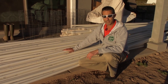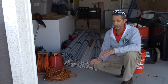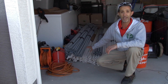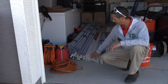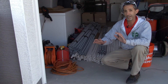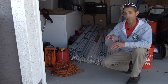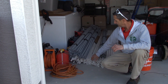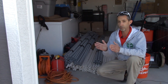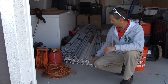This is our main line and the extensions from the main line. Now here in the garage you're going to see three different types of pipe. The first two are a one inch pipe and a three quarter inch pipe. These two pipes are what we'll utilize for shorter runs off of the valves — our berries, our grapevines, and our garden beds, which will be a much shorter run from the valve to where they're actually watering. We're using one inch lines there, and then the three quarter inch line will be the extensions off the main line going to the individual trees — only about five feet off of that one and a quarter inch main line going from one tree to the next.